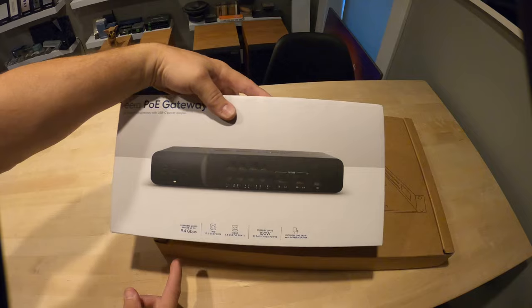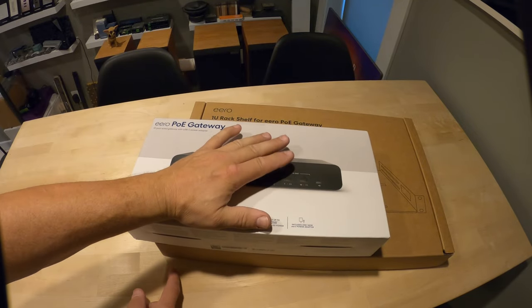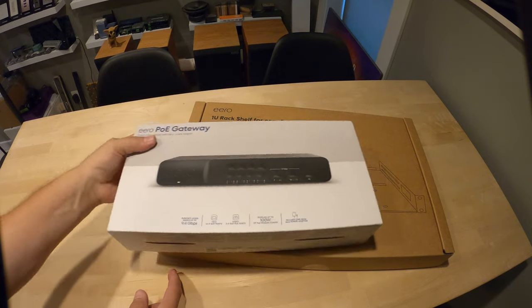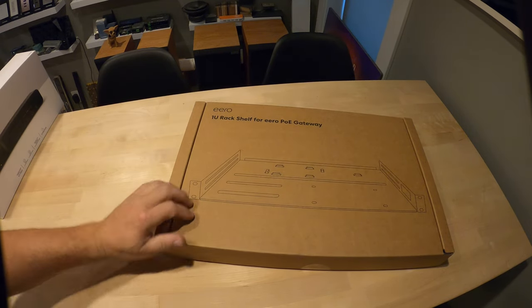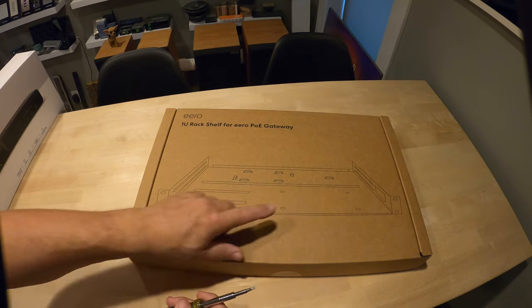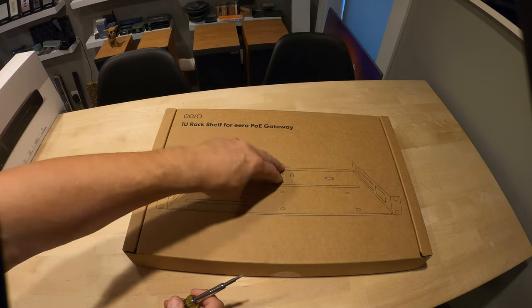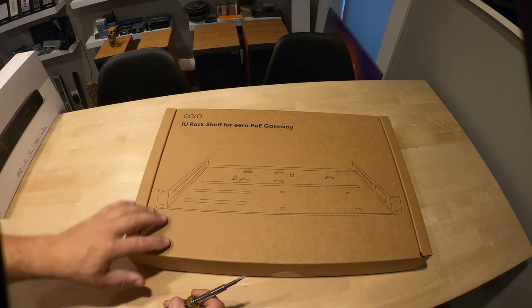So what I'm gonna do is actually, I'll unbox this, but I've already done a video on that. So there's a link in the description to the previous video. This one's gonna focus on our EERO gateway. I think the only tool we're gonna need is probably our little universal screwdriver for these screws. And then I wanna see if it comes with any Velcro or hardware. If not, we'll use some Velcro to get this mounted down.